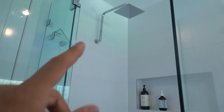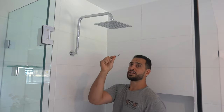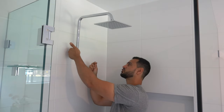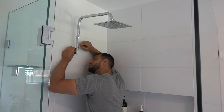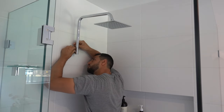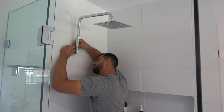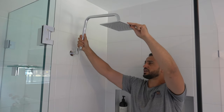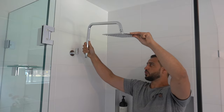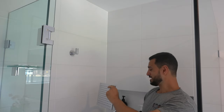I'm going to start off by removing the old shower head. Depending on the style you have it might be a little bit different, but I do have a few videos on that. In this case we need an allen key to remove a grub screw in the back holding the top arm. Just slot that in and back the screw off — don't remove it completely or you'll lose it, just about halfway. Then grab the shower head and check you've got enough space to remove it. Make sure you've got your socks off because they will get wet.